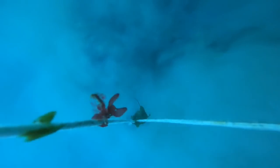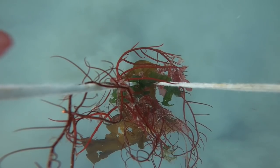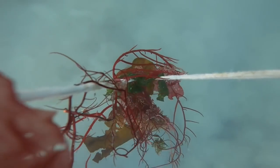And so with the holes here, it is still not capable of resetting. It will not bring the boat to a stop. If I let the boat stop, turn it around and pull in reverse, it will eventually produce some holding power. So I'm going to say that holes in the fluke only improved the anchor, but it certainly is not as good as virtually all the other modern anchors for this test. If you remember from the Manson Supreme mod, just drilling holes in the fluke cured it completely. For this seabed, it worked 100%. So there's something else going on, and I'll keep investigating.